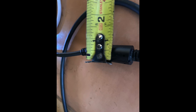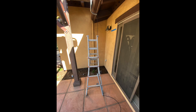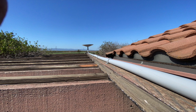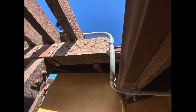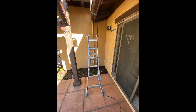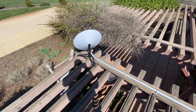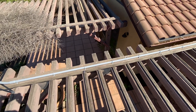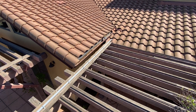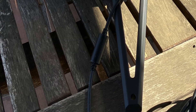I wanted to make sure I had enough room to get the cable through my 90-degree bends in the conduit. Normally when I run wire through electrical conduit, I'll run the entire length and then use fish tape to pull it through. But since I had so many 90-degree elbows and a transition where the wire went into the house and down into the wall, I wasn't able to do it in one shot, so I pulled it in sections. I glued the section on the pergola first, pushed the wire through, fed all the 90s over the wire, and then glued it while the wire was already in the conduit. That made it easy to get through without it getting hung up on those two thick ends of the cable.